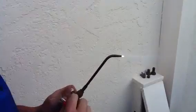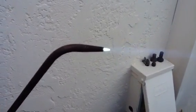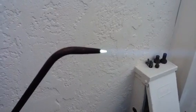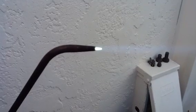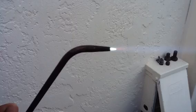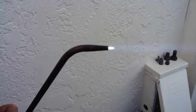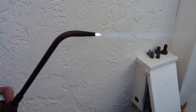Here's a good tip right here for you. You're going to have a blue flame — you see how small that tip is. The reason you want a small blue flame is so you can actually push your 15% silver solder around the joint to make the copper flow. If you overheat it you'll burn a hole in your copper; if you under-heat it it won't flow at all. It has to be actually about 1,450 degrees Fahrenheit.